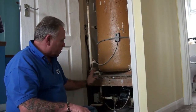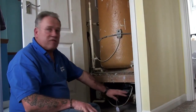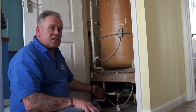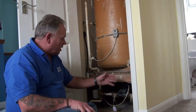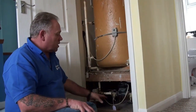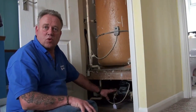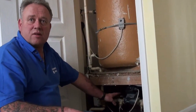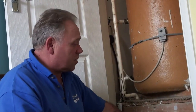Once the water has been sent round the system — that's the flow — it flows round and round the system and is then returned to the boiler to be reheated, and the whole thing happens again. So it's one giant circuit which is completely separate from the domestic hot water — the water you bathe in and drink. It's important to know that because we get a great many questions about how you separate them — they're never mixed in the first place. They're two completely separate systems.